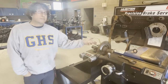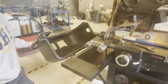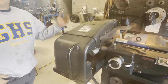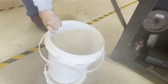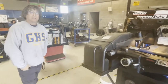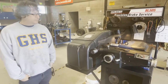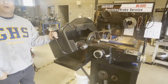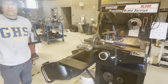The shavings that come off here — the EPA considers this hazardous waste. There's a lid on here while you're cutting; you can close the safety lid over the top, and that directs all the shavings down to a little funnel below and then into a container. When this fills up, we have to send it to a recycling plant — any kind of debris we make here has to be recycled. I like to keep it open when I'm doing a demo, but normally if I'm cutting a rotor and walking away from the machine, I close it down for safety.